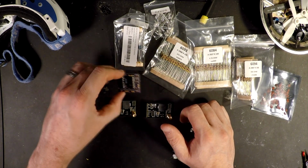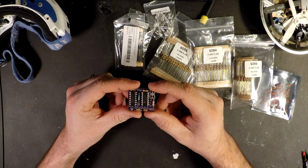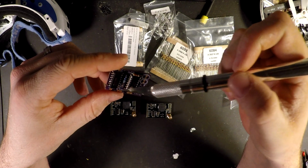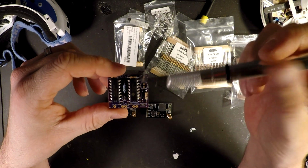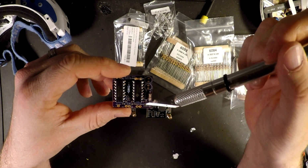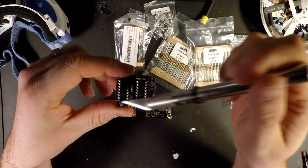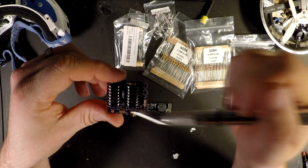First things first, we need to get everything else soldered onto our little board. If you look on the board, it actually has everything labeled. So these chips, like I said, I'll list everything in the description: CD4066 and LM324N. Underneath these chips, it tells you which direction they need to go as far as where the little divot is. LED1, LED2, 47K resistor. You've got your capacitor, video out here, VCC and ground off your battery.